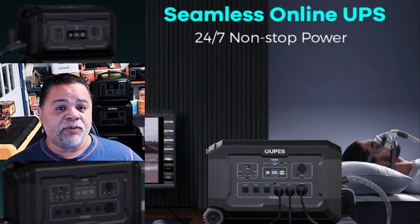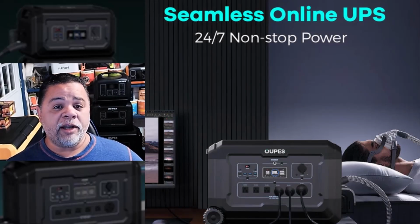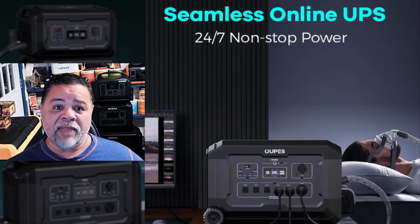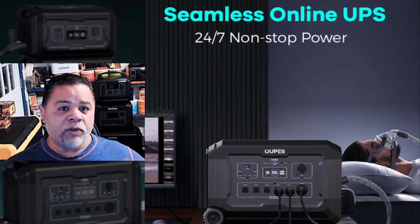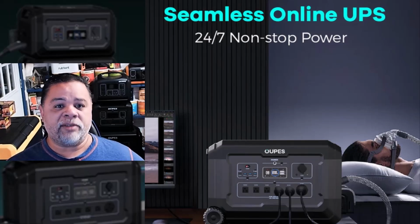Now the UPS function on this, ladies and gentlemen, is superb. UPS stands for uninterruptible power supply, and this has a UPS function of 2,200 watts continuous, meaning you can be pulling energy from the grid through this machine, bypassing the battery. And then if the grid goes down, as long as you have your appliances plugged into this machine, your appliance is going to keep running whether the grid is up or not.